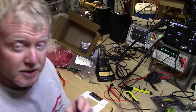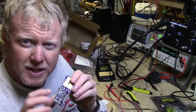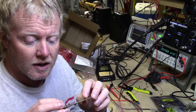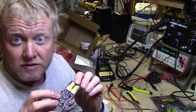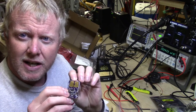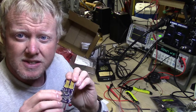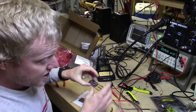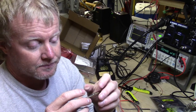Okay, I've taken a look. On this particular board, I'm fairly certain that I'm going to have to do a little bit of rework on U4. But it's actually not the solder process. When I took the datasheet information from this chip, I either used a really tight tolerance on the recommended footprint, or it was just off completely. It looks just a little bit narrow, and the part is slightly shifted, so it barely caught maybe two of the pins. Ideally, to make this part a little bit easier to solder, I'll probably just increase the pad size in general. This other board got more centered up, and the part is connected just on the very back edge of the pad, and should work just fine.